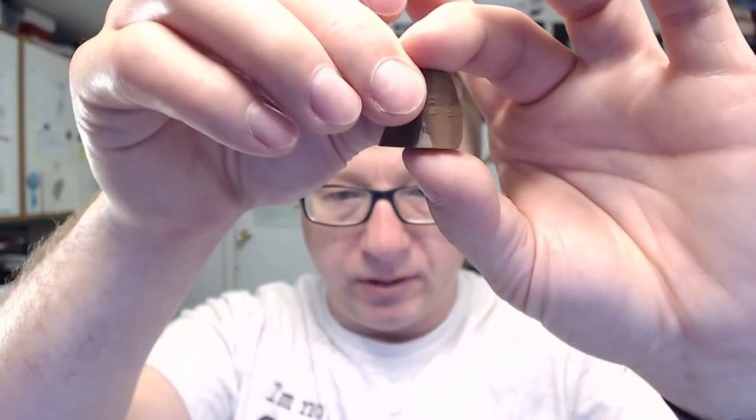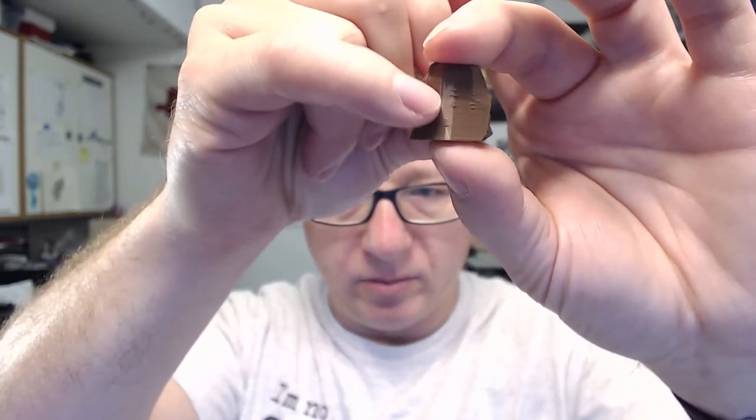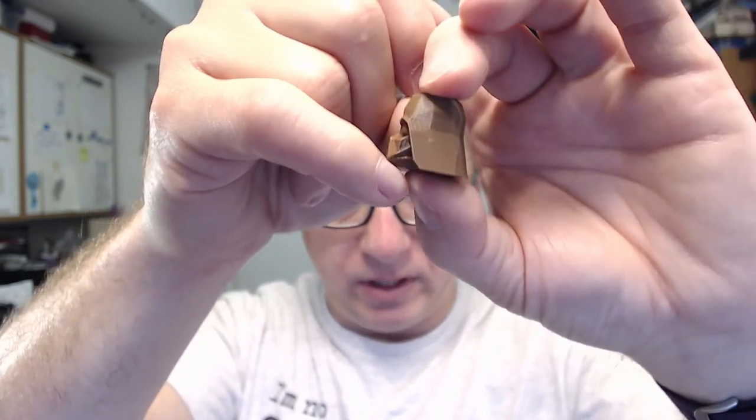This is coast and wipe off. You will see right off the bat that artifact there is still there, but it's a little bit better. There is some zitting here, and then on the other side there is the artifact again. So it seems to be pretty consistent — at least in Simplify3D — where it's putting these kind of retractions.